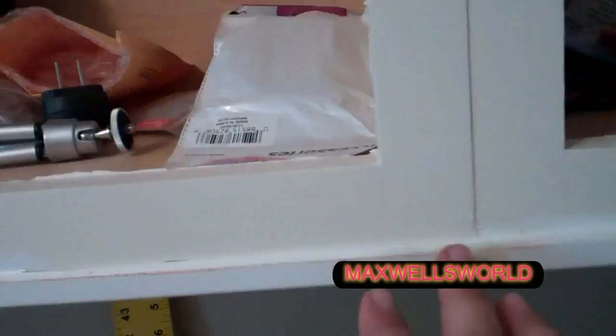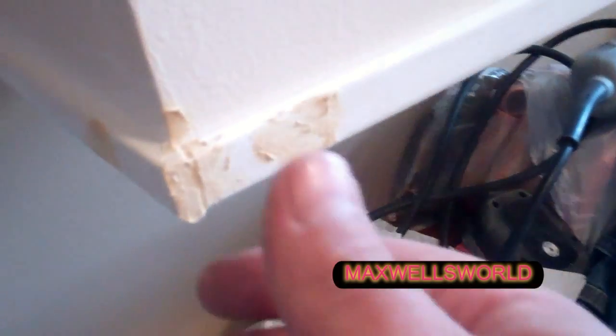In the meantime, what I done is I went around and touched up all the seams that were a little bit exposed, all the brad nail holes, all that good stuff. Just touched them on up with the wood filler, and of course just give them a sand and they'll be fine. As well as I went around all the seams, all the joints, and filled them as well.